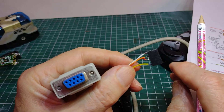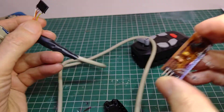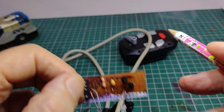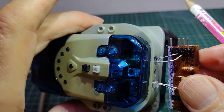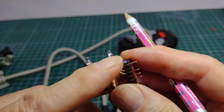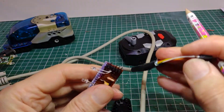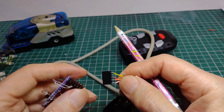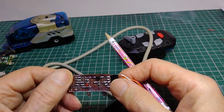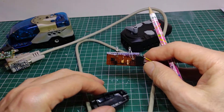So we've built this thing. It's a bit rough but it seems to work. All I've done is point the photo devices outward, and they just push into the back of the brick. I have to make sure I get it the right way around — the light coming out has to go into the photo detector, and the LED coming out has to go onto the detector on the other side. This conveniently uses a five-pin connector that plugs straight on, and that then just plugs into my computer — and it's worked so far to actually program the brick.